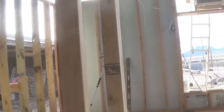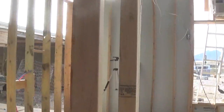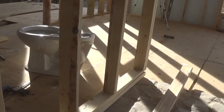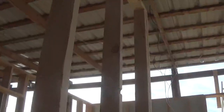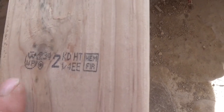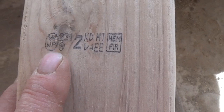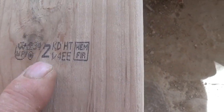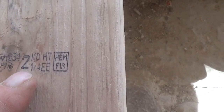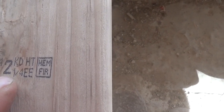See that choppiness in there? And the fact that it's coming from the end of the tree where there's bark — I think it was an anomaly where they had gotten this lumber from High Cascade. A lot of this two-by-four that I was complaining about — not here, but to my wife, to poor Debbie — a lot of that is this High Cascade. It's still number two lumber because you've got 33 and a third percent clear on that side. That tells us who made this lumber. Number two tells you it's number two. It would say 'prime' if it were prime. So it's number two common. What's the difference between two prime and two common? It's a whole different grade — two prime is a much better grade than two common.